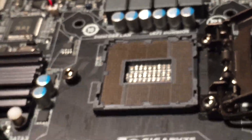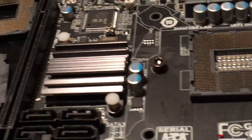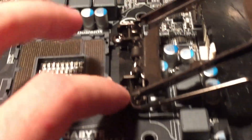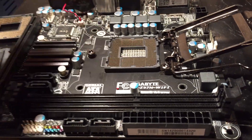What I'm going to do now is get my board on my board preheater and begin the process of heating the board up and preparing to remove the original socket. Before I do that I need to remove the metal piece and the little retention bracket on the back of the board, as well as anything else that can be removed like the battery and the Wi-Fi card. Once I get all those things off, we can begin the process of removing the socket.